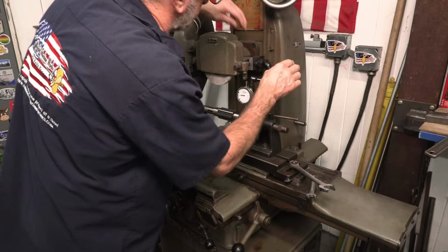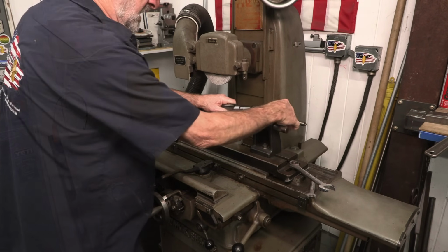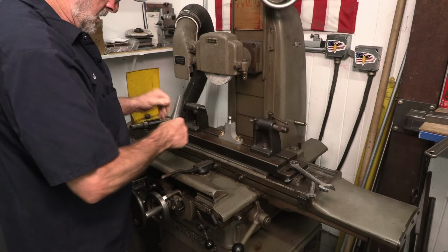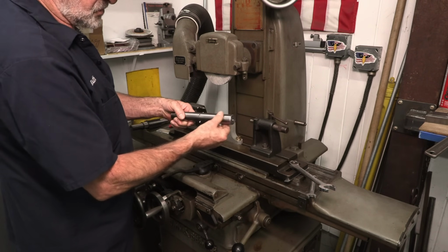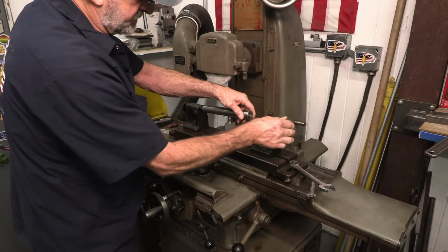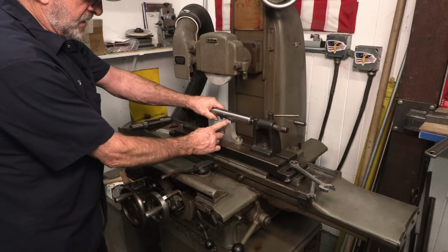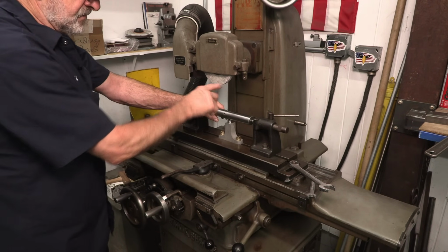Okay, let me pull my mag base off of here because we know that we are true. We're going to pop the shaft out of here for a minute, and pop in our second tool. We found a piece of cold roll, which has a nice finish. We center drilled it at both sides so that we can put it in here. We offset our ball locator and the spline setup so that we can flip the shaft.